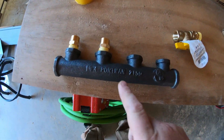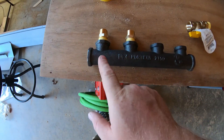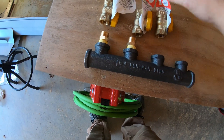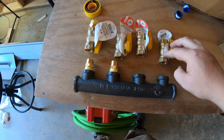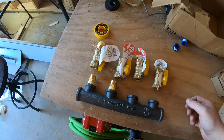What we're working on now is getting our gas manifold put together. We're going to have our gas line coming in with four shutoffs. We only have three devices that actually use the propane, but we're going to do a fourth one, get the shutoff put in, and then put a plug on the other side. That way, if we ever need to add a fourth device, we'll have that option available.